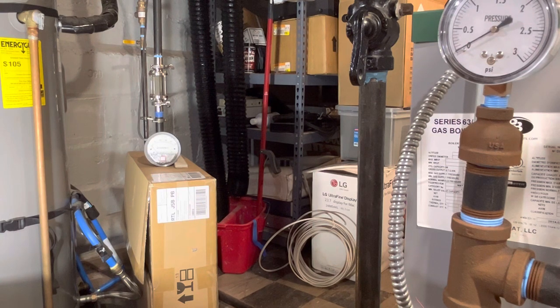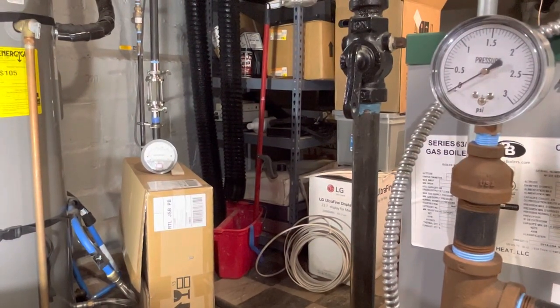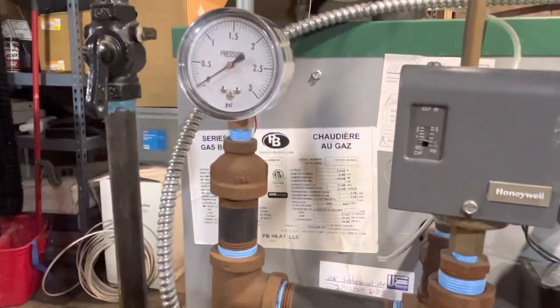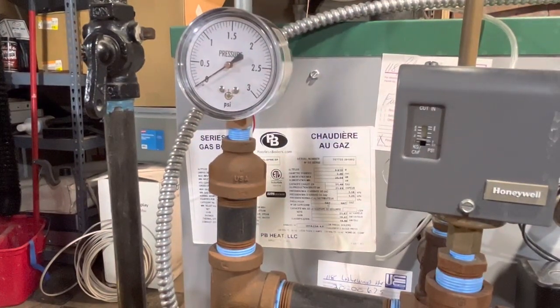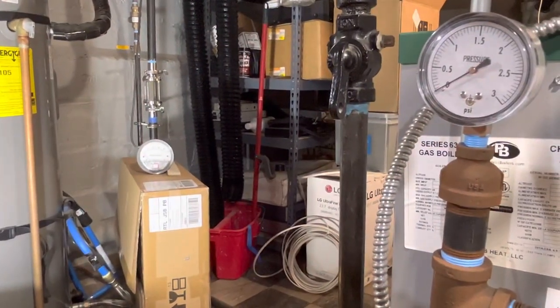And we're gonna see it lose pressure a little bit here, because first of all, the cycle guard turns on every 15 minutes for 60 seconds. That won't lose too much pressure, but then the pressuretrol is gonna kick on periodically. We should get a chance to see the pressures go up and down. I think they're going to go up and down similarly in both of these gauges.